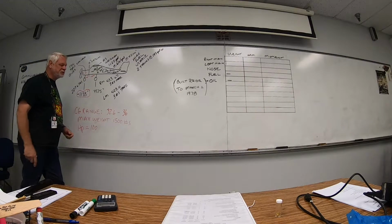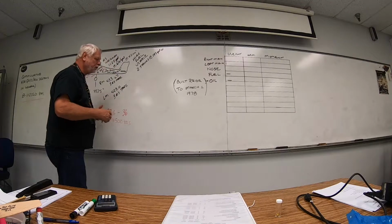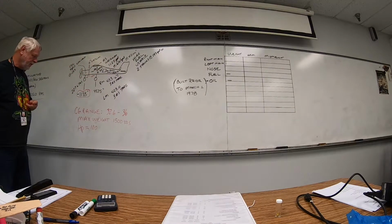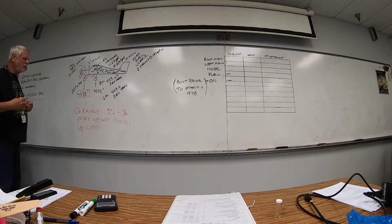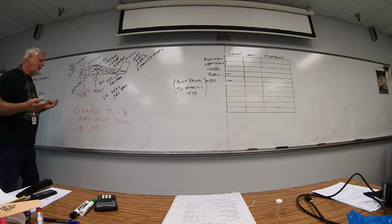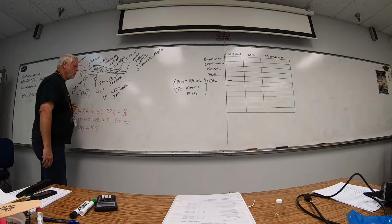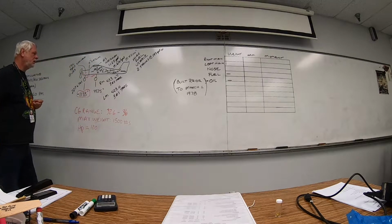Now, after March 1, 1978, you top it off. However many quarts it calls for, that's what you're going to put in, either mathematically or physically. If the pilot wants to fly at a quart low, which is pretty typical, then you might mathematically add in a quart to top it off.